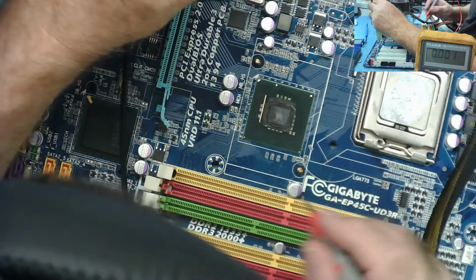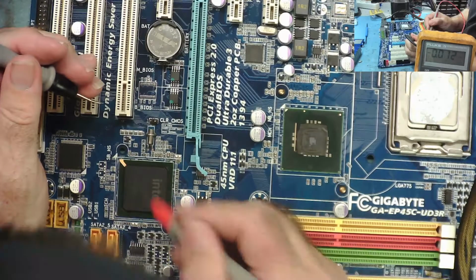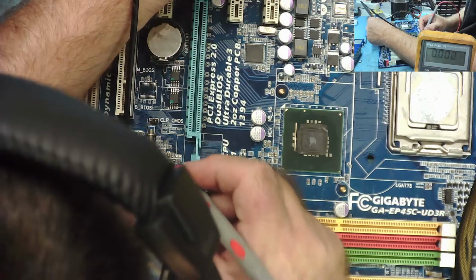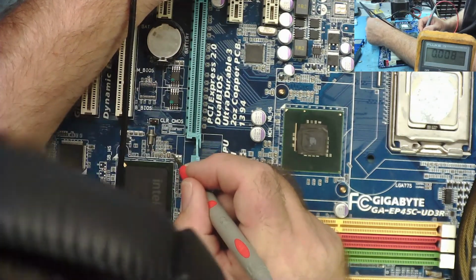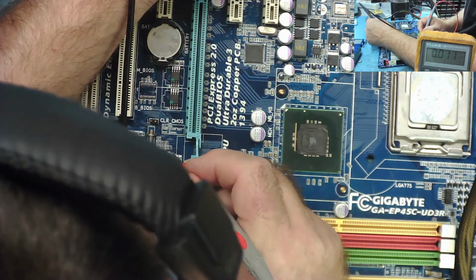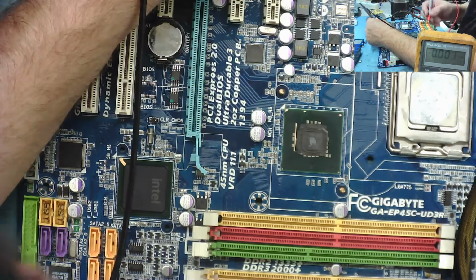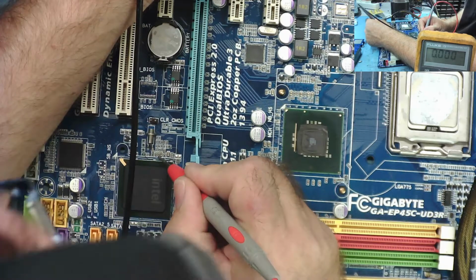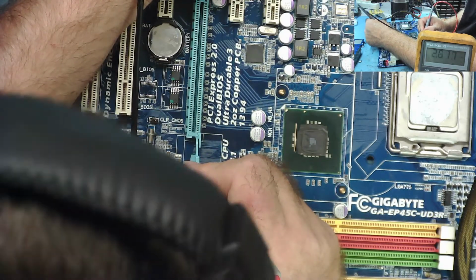No, I would expect that to have some supply, and I also thought there may be some sort of standby supply around by the south bridge. So does it see anything down here? I'm just looking on capacitors in the area to see if something's showing some voltage. I keep convincing myself that I've got 5 volts. Yeah, that's 3. Got something here.